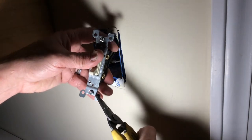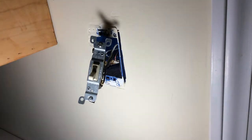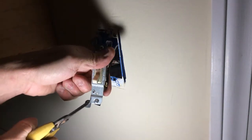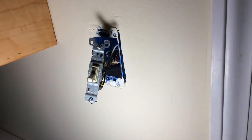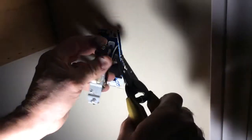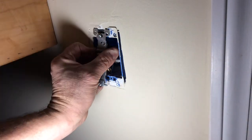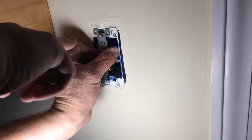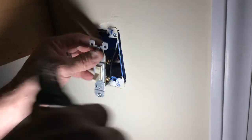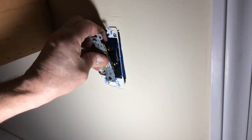Go ahead and take your wire strippers or a pair of pliers and break those off. This is only if you have a box that is cut in — or if you're not sure, just look at the switch that you took out. What will happen is if you put it in with the tabs, the switch is actually going to sit up a little too far and the faceplate may sit up too far. With them off, you look at the bottom here — they will actually sit in flush.